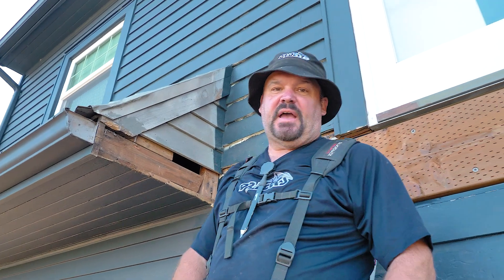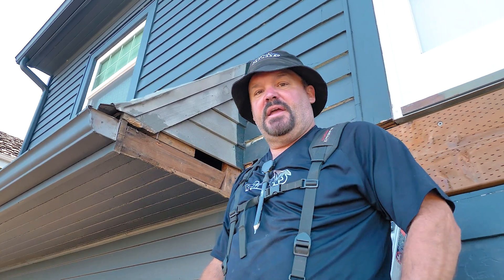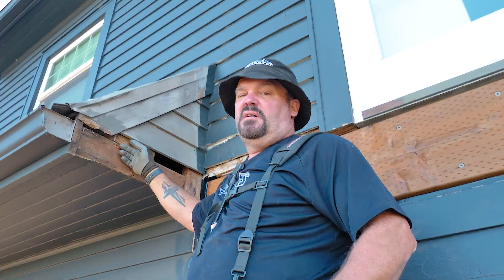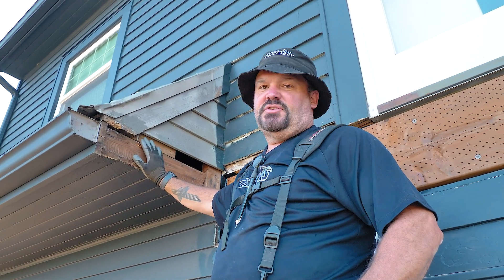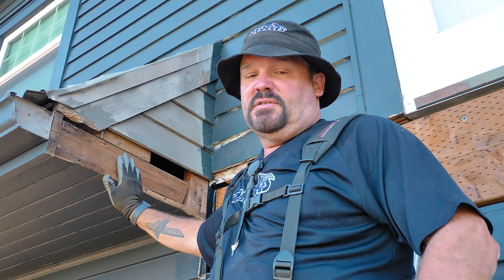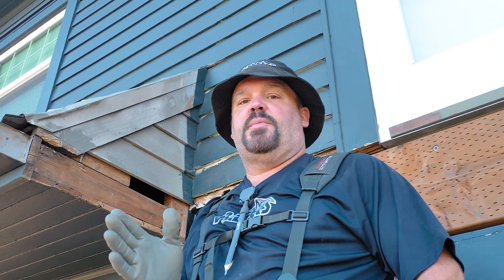There's a little bit of a funky roof line on this house. The deck is being shoehorned in between these two little offset roofs — it's just a detail they did back in the day, but they weren't sealed up real well. A lot of the lap siding on this house didn't even lap; it was just butting in, and somebody had caulked them and did some really funky stuff. So what we're going to do is add a piece of Azek multi-width dark hickory here, since that's the trim color of our deck anyway. We're going to dry this in and put some Z-metal behind here to make this fit properly because our deck is being waterproofed. If any water comes this way and hits this, it drains down and doesn't rot it out because it'll be Azek instead of traditional cedar or wood products. I don't have those products here today — I'll bring them tomorrow. We'll frame some of the rest of the deck today and then get to that tomorrow, and then we can put up our doubles on the outside edges of the deck.